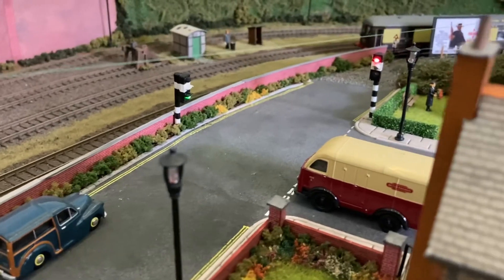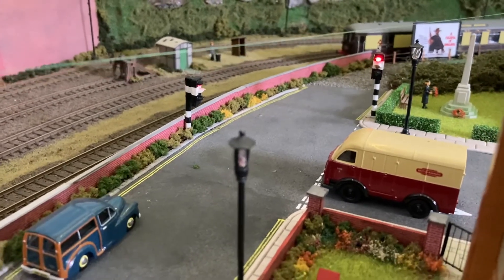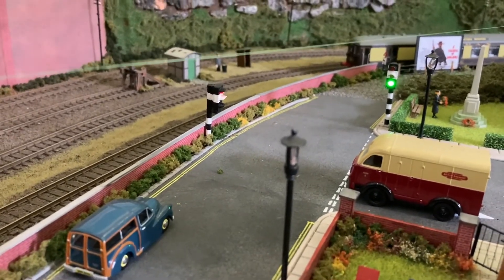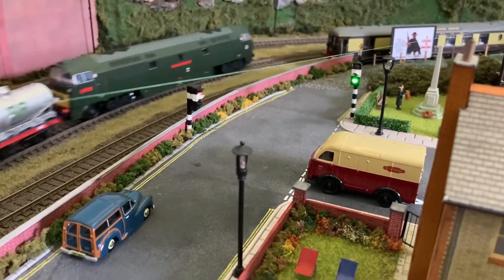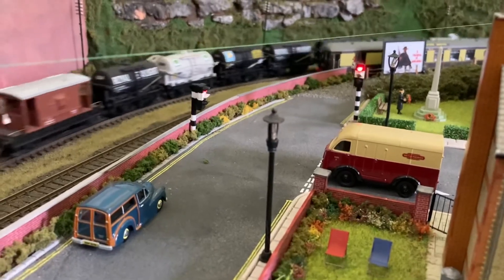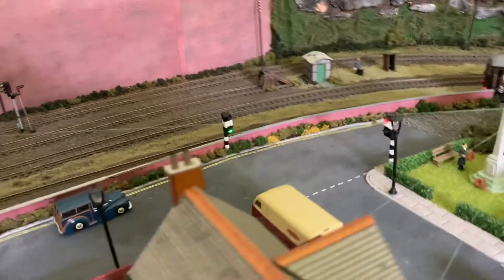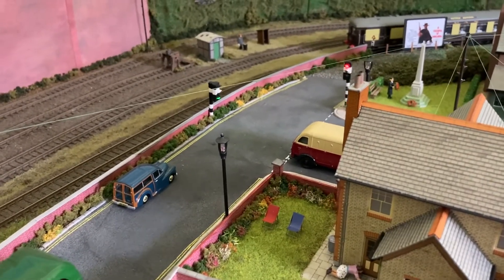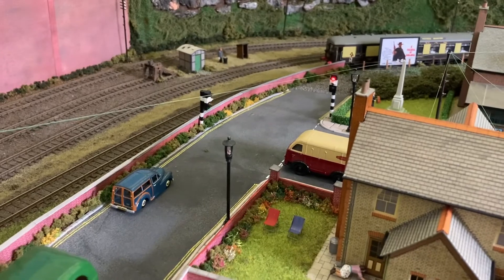Well there we go, first attempt and that's all looking OK. They're a little bit larger than I would have liked, but that's life — I'll probably put up with that. I've set the greens to about 15 seconds. So basically I've got this one here and this one here now linked together going through their little sequence — green there, then it'll go to amber and red, and this one will go from red and amber to green. What I'll probably do now is have a go at converting the simple delay statement into a more complicated millisecond function, and that will give us more flexibility in how the signals can work.